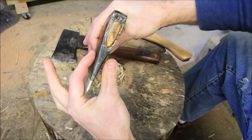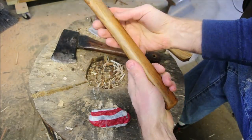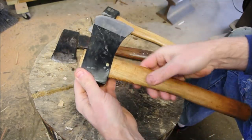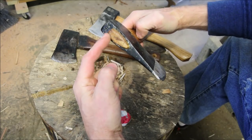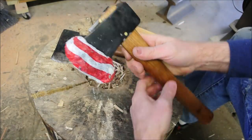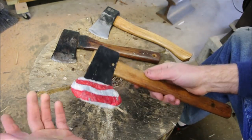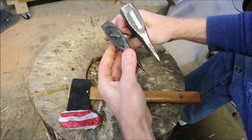This one has a real slender head and so it doesn't work so well with that. This is a Harbor Freight hatchet — I made the handle. It is hickory, I believe, from an older one. This had some kind of pin in it from the factory, so I drilled it out and put a piece of brass in. It's mostly cosmetic, but you may as well use the hole since it's there. I don't use those metal wedge pins — they're a redundancy at best. It seems they cause an additional variable that expands and contracts differently than the wood, so on the whole I just find it to not be a good idea. You end up losing too much time removing them; they always end up wiggling loose, as these two will attest to.